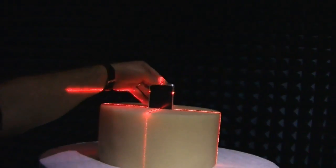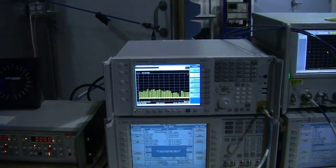We put it in the anechoic chamber — it's not as many bars as it had before, definitely. We're going to go ahead and make the call. When doing a test, you dial into the base station with any three numbers and it will connect. So we're dialing into the tester and running the exact same test we just ran. What we're running into is the fact that we're falling below the noise floor of the instrumentation — the signal is already so low that to accurately measure it I'm going to have to slow the test down and take more data.